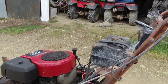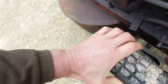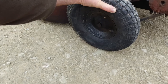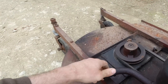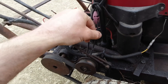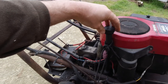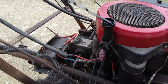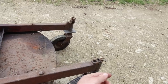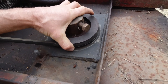Pull the handle and it tightens the belt and drives the wheel. Everything's all pretty slogged out — it's probably going to need bushings or something. It's probably out of round by the look of how long it's been driving on that shaft. The exhaust is flopping about, it's got a few aftermarket additions — a little bungee there being used as a spring, tied around the oil thing. It does have oil, so that's good, slightly over full. There's a nail holding the wheel on, which is a bit of a mess but possibly fixable.